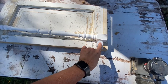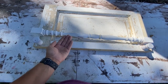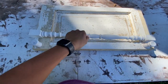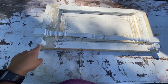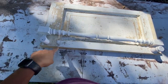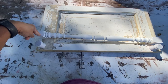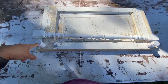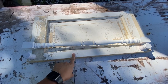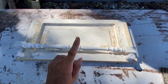I've drilled holes through these little end pieces to give me room between this back piece and the spindle so I can hang a towel in the bathroom. I've pre-drilled some holes and I'm going to screw and glue these pieces to the base, then screw and glue the spindles to the little pieces. Then I'm going to spray paint the whole thing — I'll probably spray this piece first, sand it down, and distress it a little bit.